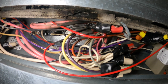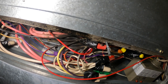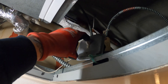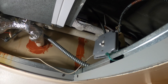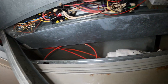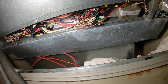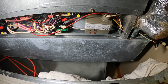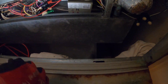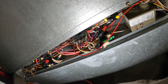The first thing I noticed is something stinks. And look at this — crispy, you got crispy wires here, man. So the first thing I'm going to do is kindly turn this off. We also got to make sure there's no other random power source to this, because sometimes this is a two-pipe fan coil unit with emergency electrical heat and we have two power sources. Got to be real careful on that.